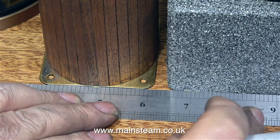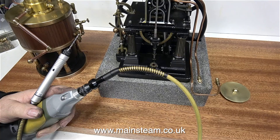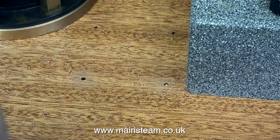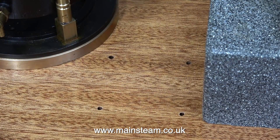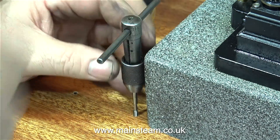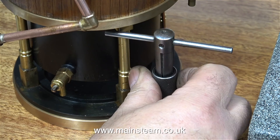While the condenser oil trap is still bolted to the main chimney inlet, I use a ruler to make sure that the base is in line with the plinth that the engine's mounted on, then I make four spots using a felt-tip pen through the holes. Using my excellent Proxxon flexible drive, which is very small and gets into inaccessible places, I drill the holes with an eighth of an inch diameter drill. Then I blow all the sawdust away using an airline before threading the holes using a 4BA tap. This baseboard is a really nice piece of hardwood, so it's very easy to tap it to take the bolts — apart from one area I can't reach.